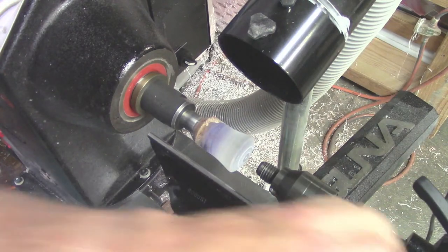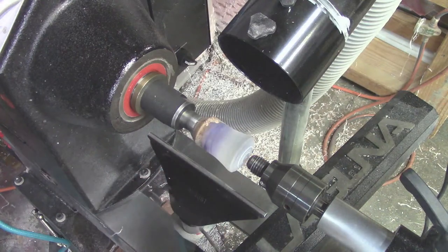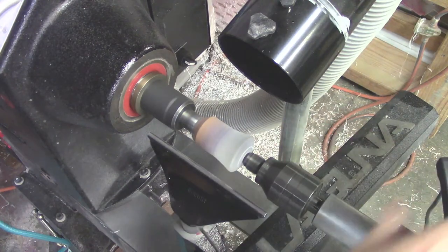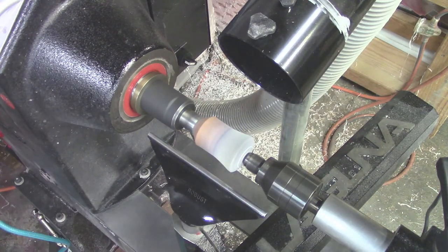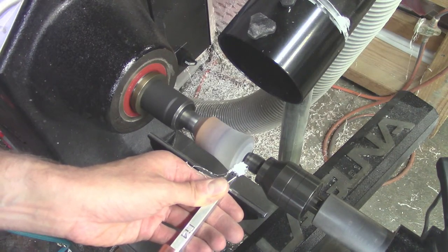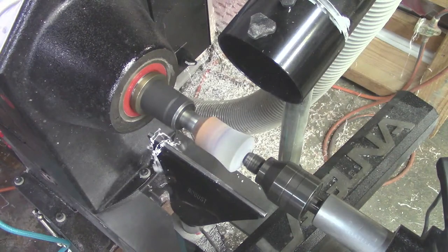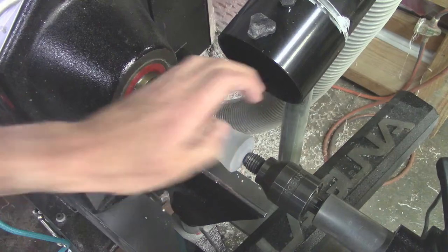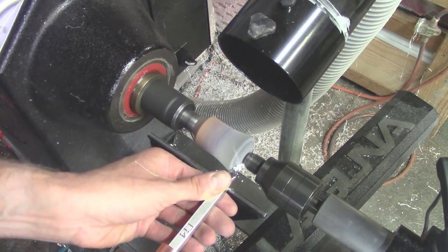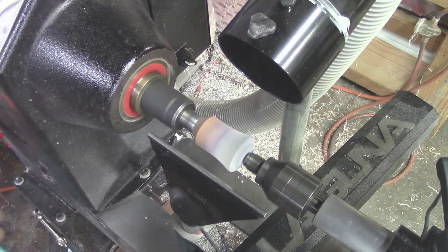I'm going to bring the tailstock back up just for a little bit while I'm nibbling. I can do a little bit of stuff on the outside of this, but I want to bring it up to do sanding. So we'll turn this back on and bring up the tailstock. I'm going to cut that off, so I'm not worried about that point going in. And I'm going to come back with the negative rake hollower. Another thing I could do is come in with the detailer. This would be a good tool to work in tight quarters like this. That actually worked quite well, probably better than the number one, to start getting the top surface ready for sanding. And then at the end, when everything's done, I'll come in and do the final bit.